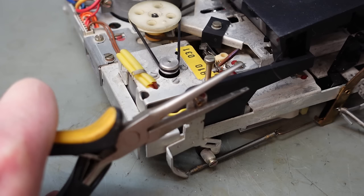It says to enter the tape tray. Now to power it on. Let's press play and I need to hold it down. Definitely something wrong with the audio output on this. I think it's intermittent. That's better. Got to turn 6R8 all the way down. Now we adjust 6R13 once we get it slowly running.